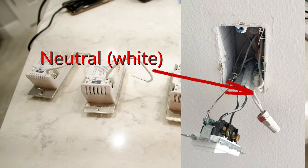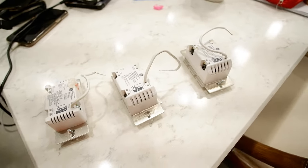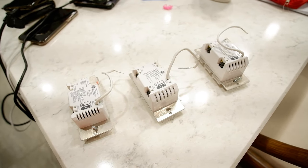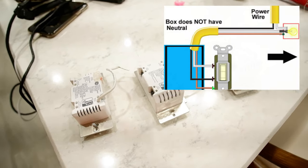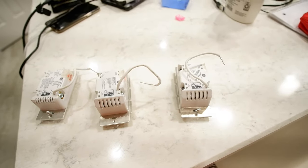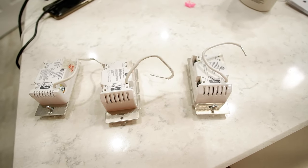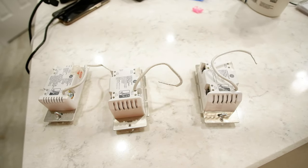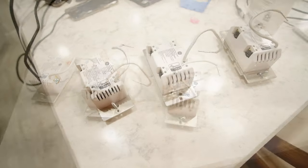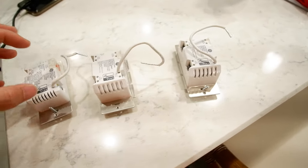For any modern house, since NEC 2008 they've been required to have a neutral in all switch boxes. If you have an older house you're probably out of luck, because back before the code change they didn't have neutral — all you had was a hot going into the box. Without a neutral you can't really run these smart switches. The only way to do it is to have an electrician run a neutral from your load down to the switch, which is a big pain, especially without conduit or if your walls are insulated.